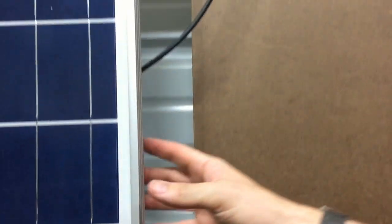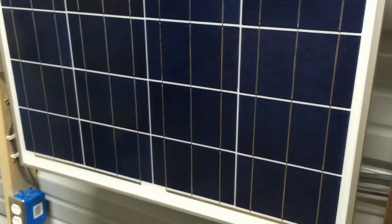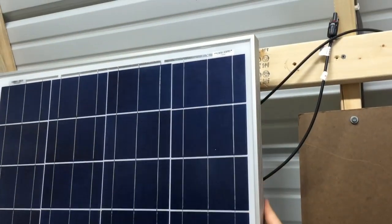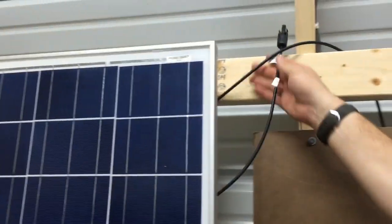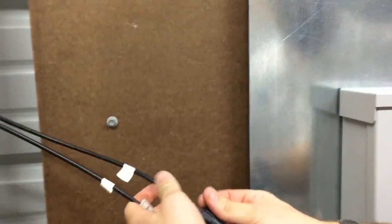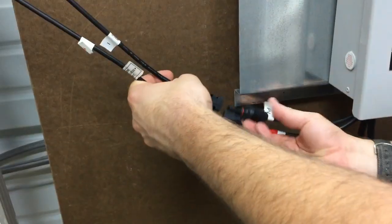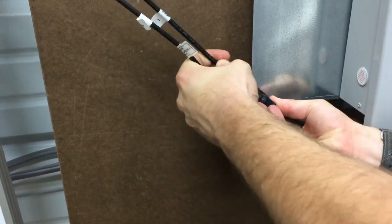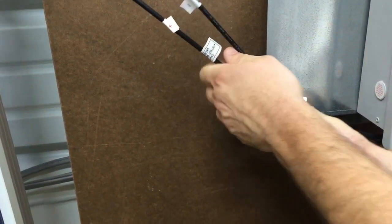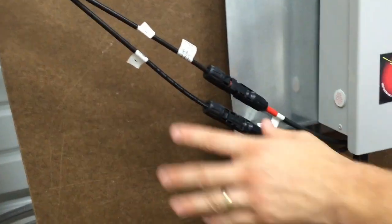What we'll do is take a solar panel. This particular one here is an 85 watt solar panel sold by hurricanewindpower.com — this is a Synthesis Solar Power panel. These panels are also marked on the lead, which makes it super simple for the homeowner to connect them. You'll take and hook your negative — I'm just dry-fitting these for the moment because we're restricted for space — and that will clip the rest of the way in for your positive. So we have our PV hooked up.